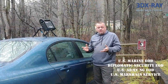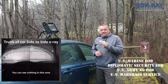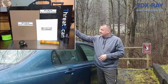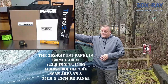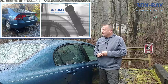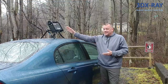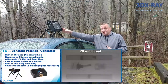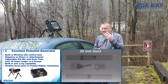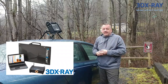I've x-rayed a lot of cars with Golden systems, trying to use mosaic systems or CR plates on the side, and I've never really had any success. I always thought that was the only tool I had — until I encountered the iGen system with the LineScan large detector panels and realized there's a much better way to scan a car. I've tested everything you can possibly imagine and showed you the images. This system — only a 120 kV constant potential generator — works much better than a pulse system using a CR plate or mosaic. You're going to get far better results with a system like this than with what you've been doing in the past.